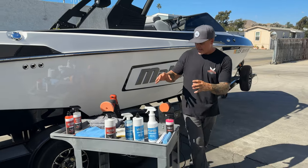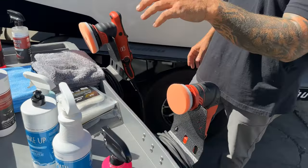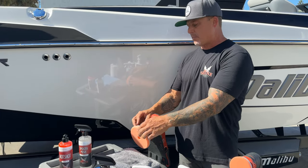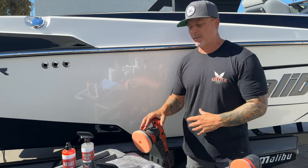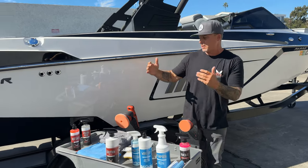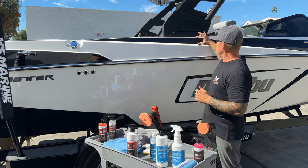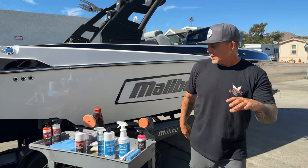I'm going to use Smooth Move in our wash process to help get that heavy scum off the bottom of the boat. I also have the Griots 3-inch DA polisher out with an HDO orange foam pad, and the Griots 6-inch polisher with the backing plate swapped out to a 5-inch with a 5-inch HDO orange foam pad. I prefer the 5-inch — it's a little more agile when working, especially in some of these areas on the boat. The 3-inch is out for some of the back areas.